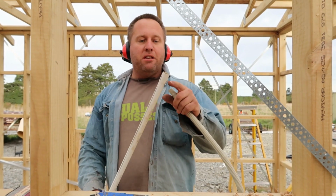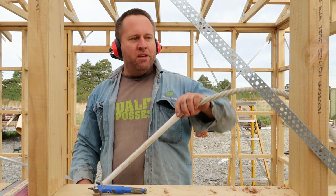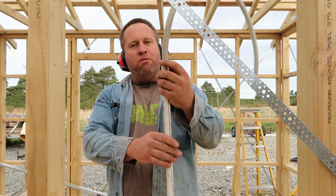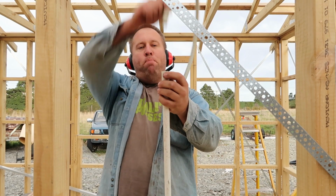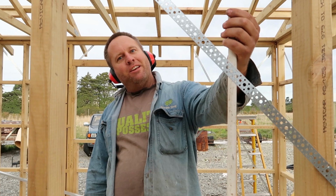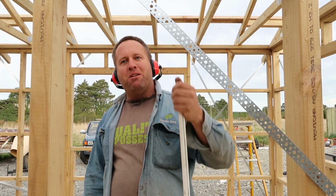Makes me very angry. They get this wide bell bit and they just push it in there loose as a goose like that. And then they wrap tape around it. What happens is it sits in the wall, the tape all peels off, and then the drain blocks up. And then I go to blow it out and it goes boom! It's somewhere down inside the wall. And you don't know where it is. I can't get my hand to it. I have to cut a hole in the wall to put the drain back on.